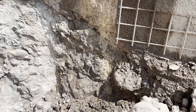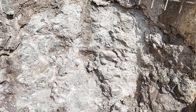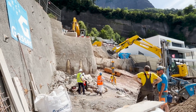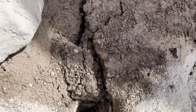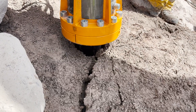The rock is quite hard. It doesn't look that hard, but it really is. They call it Nagelflu and it's a bit like concrete with hard stones embedded in what looks like limestone. So even when using a 60-ton class rock breaker, you struggle quite a bit with the productivity. Plus the noise would drive the neighbors mad.